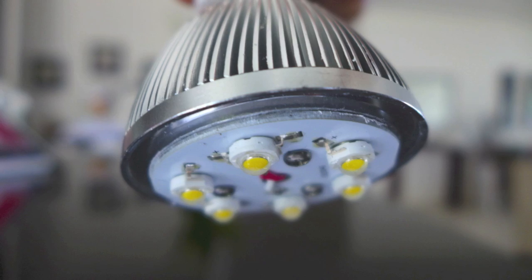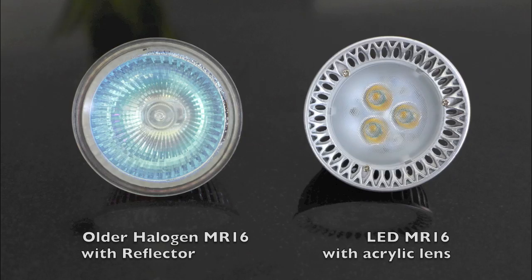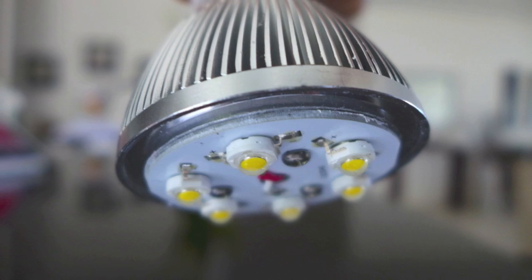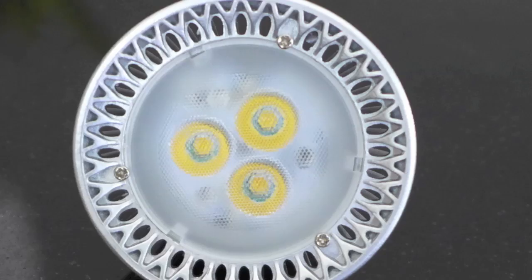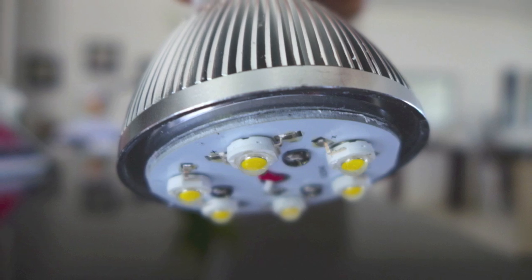There is usually some kind of cover or lens for the LED chip. This LED A19 has a simple frosted dome because the light coming out doesn't need much change. But for other types like MR16s or PAR series bulbs, the original reflector is now replaced by a lens. One great thing about LED chips is they're really small and relatively cool, which makes covering them with a lens possible. These are no ordinary lenses — engineers design them to focus the light from the LED chip into very accurate beams, with very little light lost, bending the light to offer unparalleled choice over the type of light spread and beam angle.